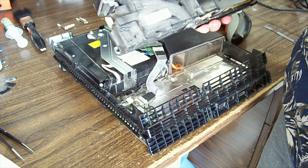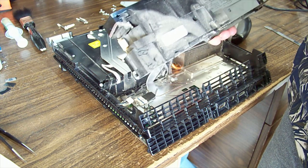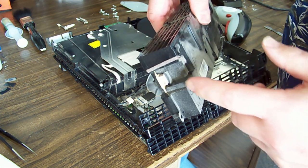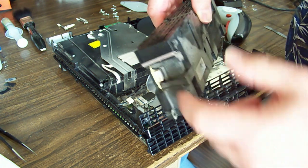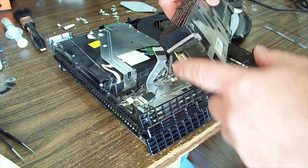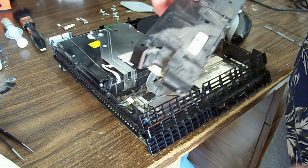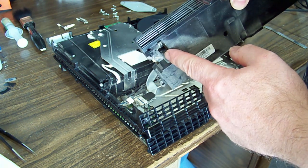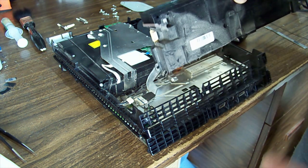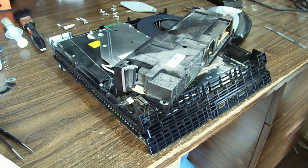I don't know if the problem is the power supply or other, so I guess what we could do is plug this in and see if we've got our standby voltages coming out of the plug there, because the motherboard won't do anything if it's not partially on to activate the rest of it. The prongs that come into here, that's for the, I believe, 12 volt high current for the rest of the system, which is only on once you turn the unit on.